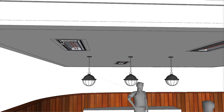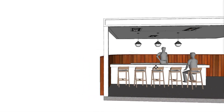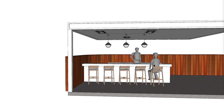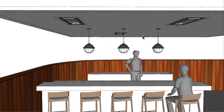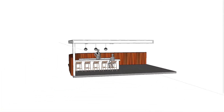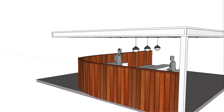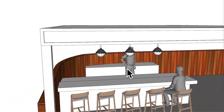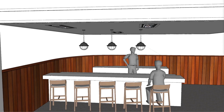I have these two units at about 7 feet center to center, centered within the span — so 3 and a half feet from the edge to the center of each heater. For the third unit over here, I'm matching the profile of the other two, but you could also go perpendicular to the other two units to get a better footprint. I have it basically centered within the span here, but if you wanted to center it, I'd move it about a foot to the right of center of the bar when running it parallel with the bar.